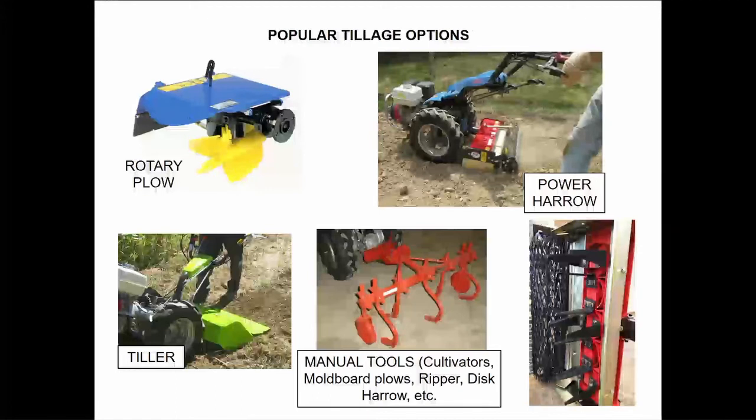So just wherever you want it. See, it locks in position every half revolution. That's about 1/8 inch increments in depth. So you can totally get this thing wherever you want it. And when you want to transport it, of course, you just crank it up off the ground so the tines don't scratch. So 0 to 5 inches depth, or 5.5. Oh, yes, very much.